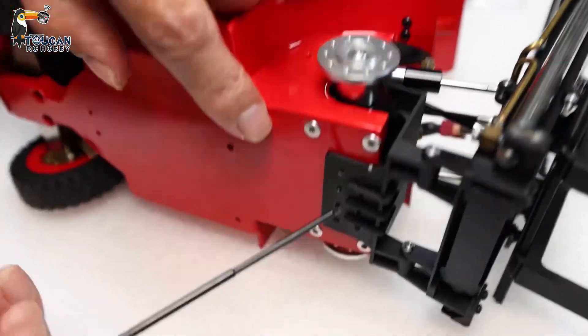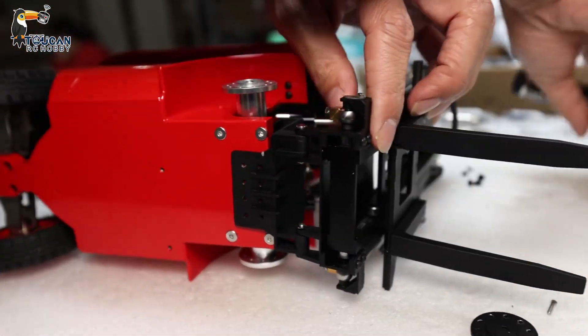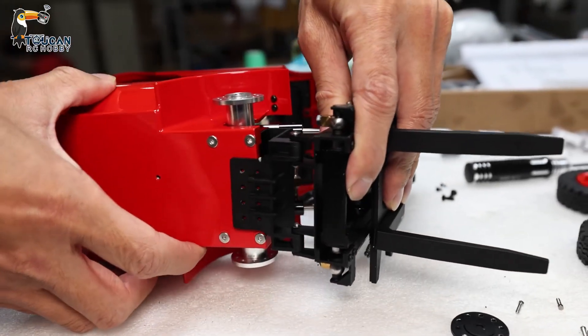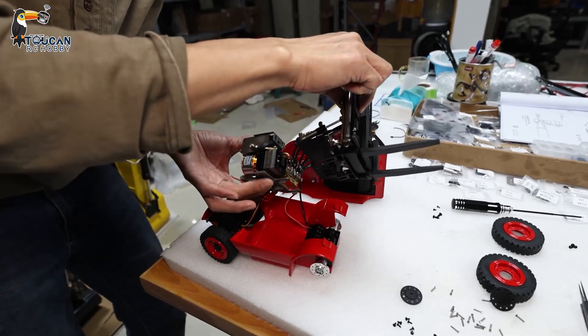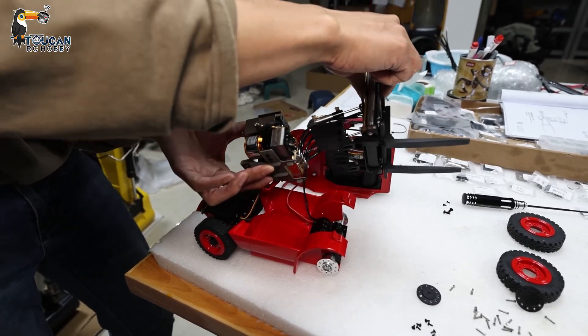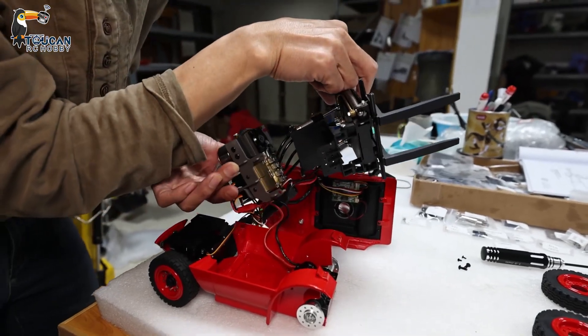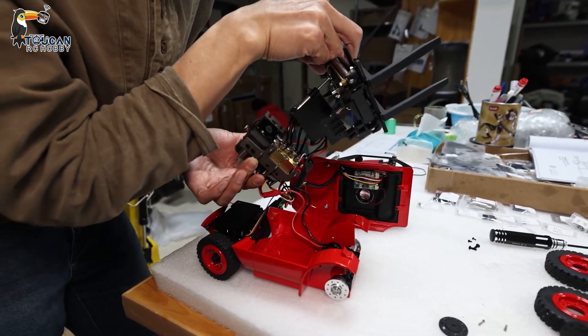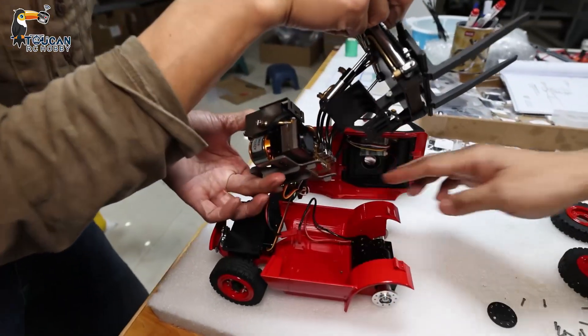Also on the downside, eight screws — one, two, three, four, all eight screws removed. This fork frame can be taken out together with the hydraulic system. Now all the pump, valve, fork, and frame are out. Only leaving the connection power line for the driving gearbox and the connection for the servo, which can be disconnected very easily.